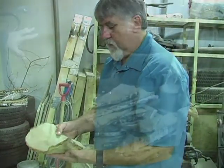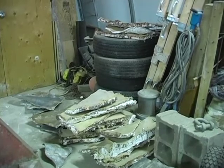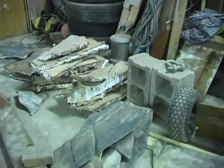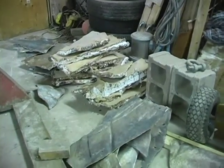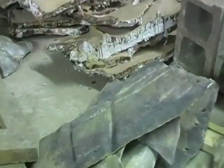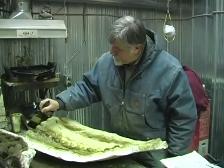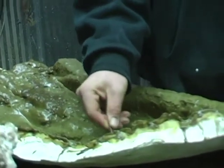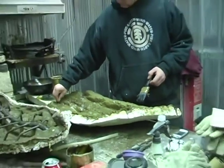Those are the molds, the rubber molds with the plaster mother mold of the original rock, taken directly from the original rock. Then on the floor beside them are now the cast sections, which were painted in wax into the molds as we saw, and then invested and then poured in bronze. The foundry wax is heated up and then painted onto the mother mold. Painting is continued until a depth of 1/8 to 1/4 of an inch is reached. Then it is checked with the gauge.